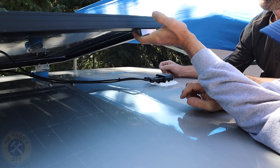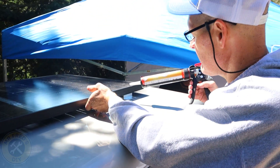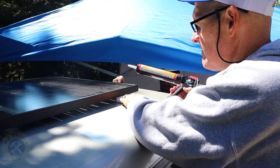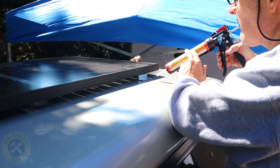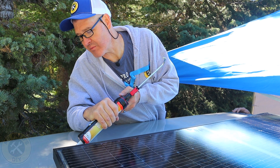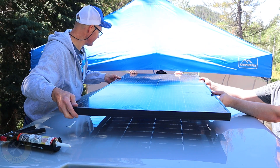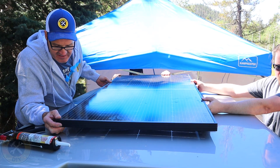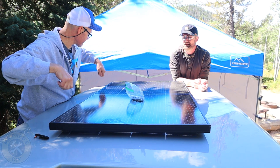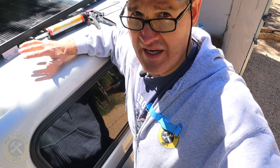The panel will be on top of the sealant, which will also help. For the Z-clips, I'm not going to be able to get to the back side, so the plan is to lay a bead on the back edge and let it spread out, then set the Z-clip foot down into it. Then I'll be able to come around and seal on top of the bolts. We're going to try to get this thing set into place and drop our bolts down in. Let's get all eight bolts snugged up from the bottom with fender washers and nylon nuts, then put the Dicor around all of these bolts. All eight bolts are nice and tight — let's take the Dicor and get that sealed all around to weatherproof this thing.